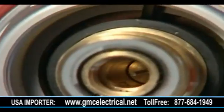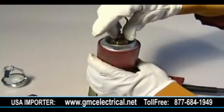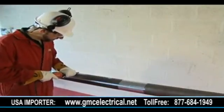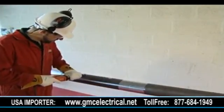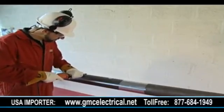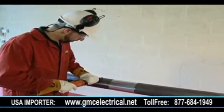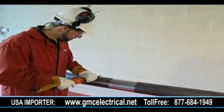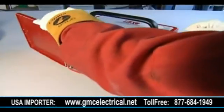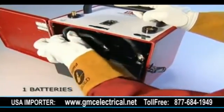Check the condition of the ejector pin to ensure it is not bent or broken, then install a new contact nipple and reassemble the gun. When attempting a braze, safety is essential. Correct PPE must always be worn, including goggles for grinding, minimum shade 5 spectacles for brazing for anyone within 3 meters, and flame-proof overalls and gloves.